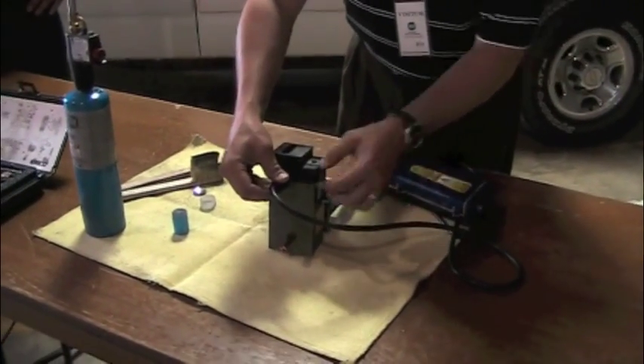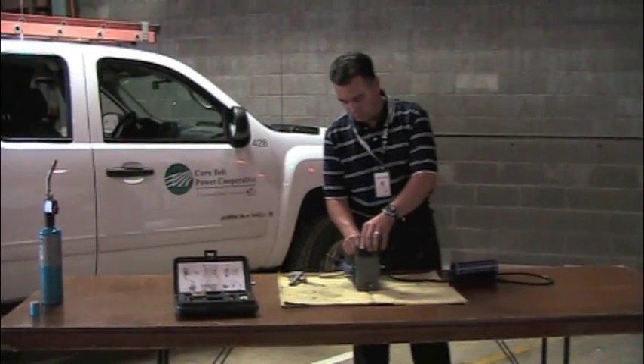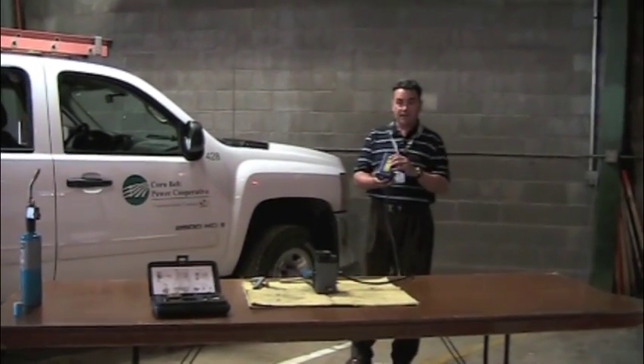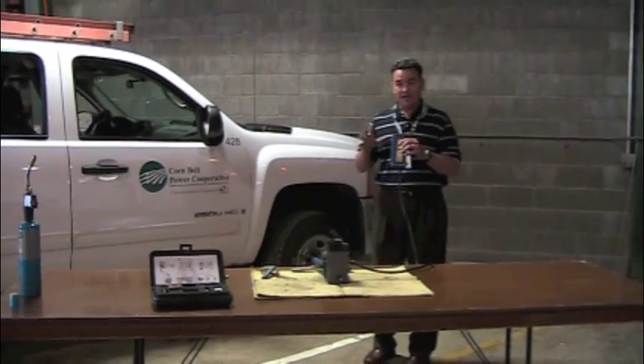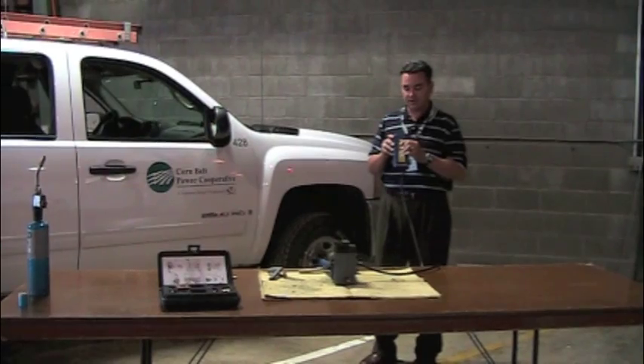We plug this in, shut the mold, have the clip out — fire in the hole. It's not gunpowder, it's not cadmium, just copper oxide and aluminum. We react it — it's a thermite reaction to make a solid copper connection.